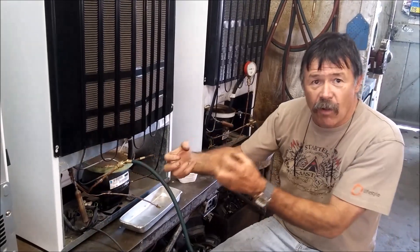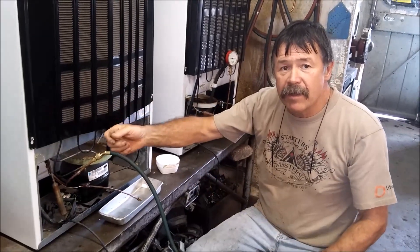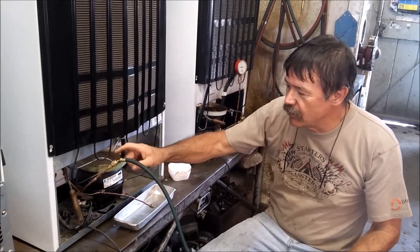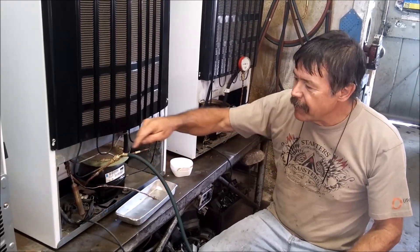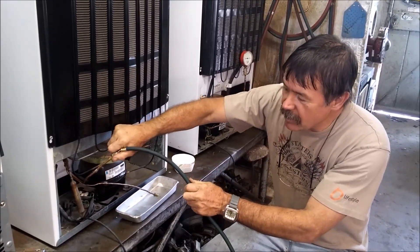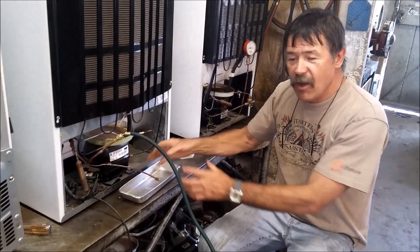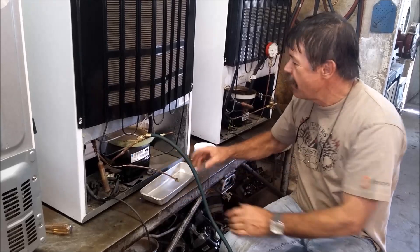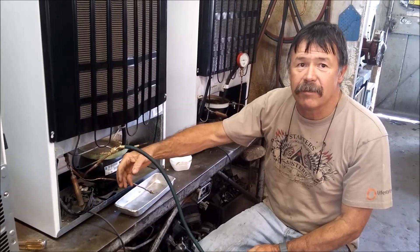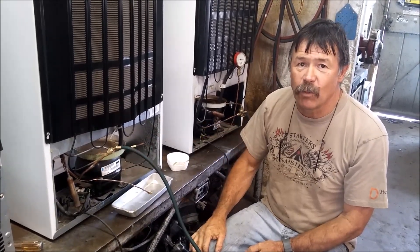What the thinners does is it dissolves the resin inside the capillary but it moves the dirt around, and once the thinners dries, this resin is even harder than before. So you want to blow it out as quickly as possible with the 404 until it blows evenly. Then I will put some thinners on this side and blow about 50 mils of thinners through the system with the 404 until it comes out clean and we're sure all the resin is out. The thinners left behind I will clean out with a refrigerant flushing system — I use it to remove the thinners once we've cleared the blockage, not to clean the dirt.